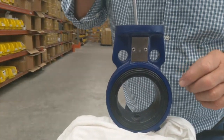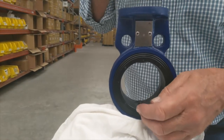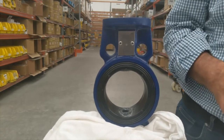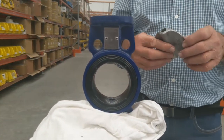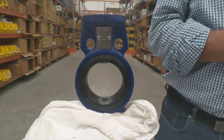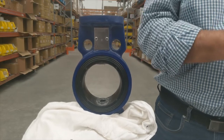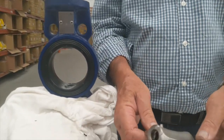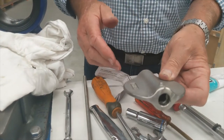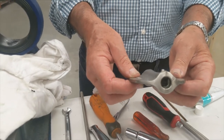So we do that top and bottom. Before the disc goes back, the disc shaft itself is curved to increase the flow. This disc is what they call lenticular in shape — in other words, the flow path through it is very good. So JMC butterfly valves have got very good flow characteristics.